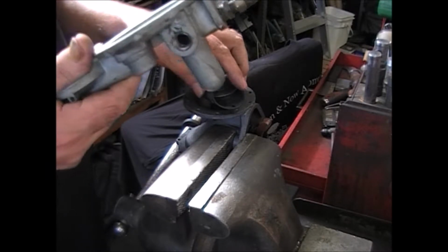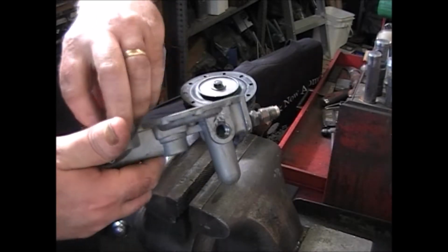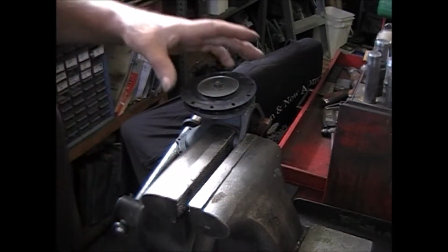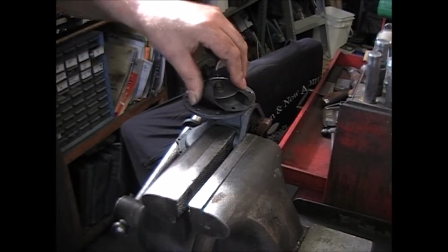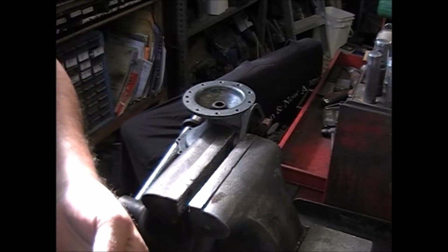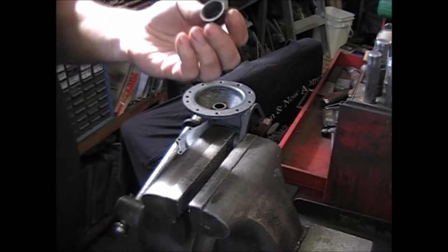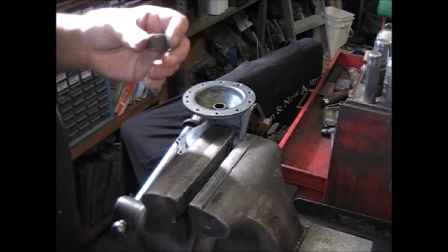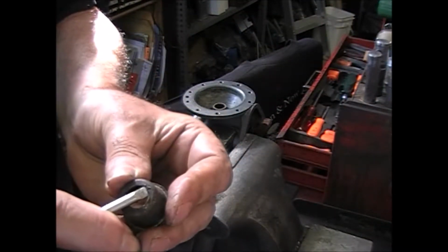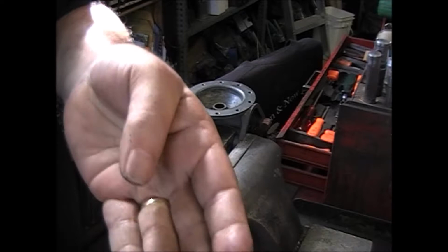And it's already got our valves in it. So somebody's changed it at one point. Our gasket and our screen. Again, on your fuel diaphragm, just turn it 90 degrees and it'll unhook from the link inside. Underneath that, it's a little cap, and inside there is your oil seal. You'll get a new one of these.